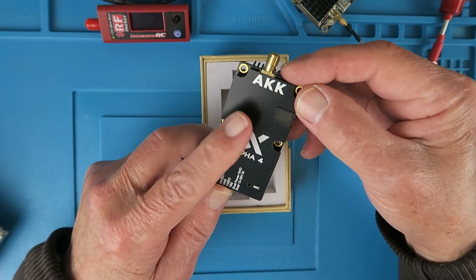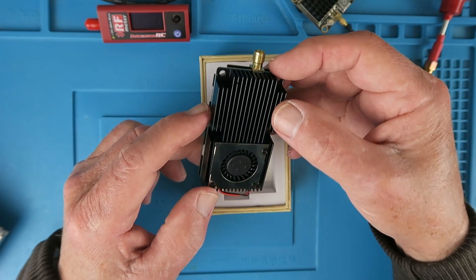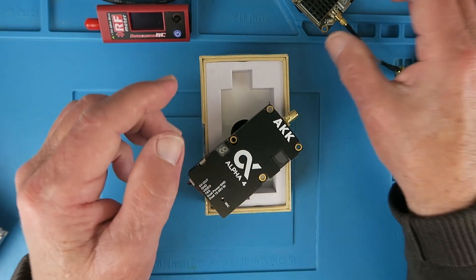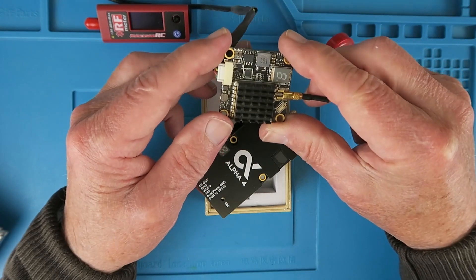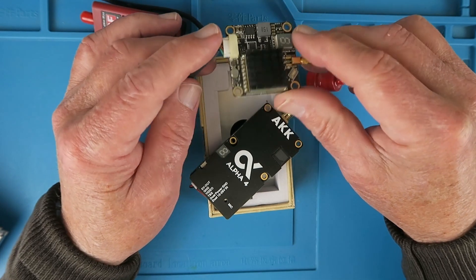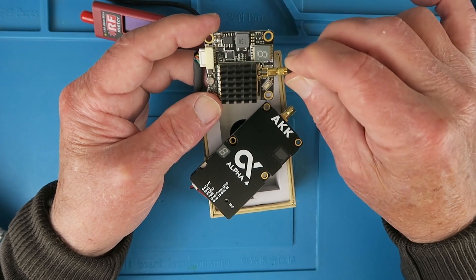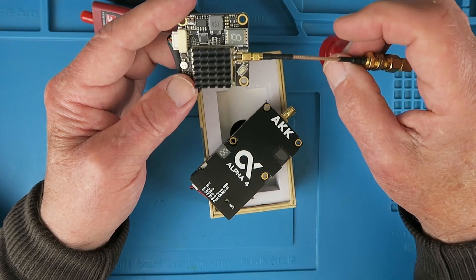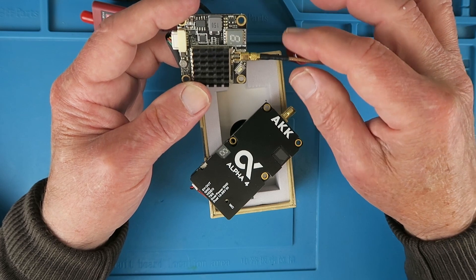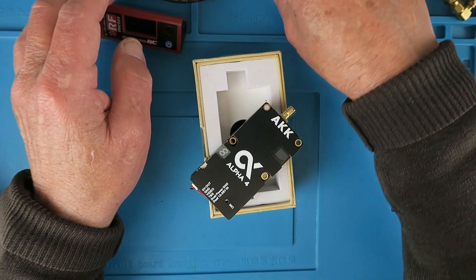The module has a metal casing, and on the back there the heatsink even has a built-in fan, which is a really nice touch. Another thing I really like is that it has the SMA female connector. Back in 2019 I reviewed the AKK FX Dominator, and a couple of things I didn't like: one was that it runs pretty warm, and even with the two heatsinks you need good airflow. And one thing I really didn't like was this MMCX-type connector — there's a high degree of variability in those little pigtails, and as you're going up in power that's going to be more and more important. So they've moved away from that, which is good news.